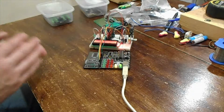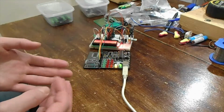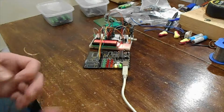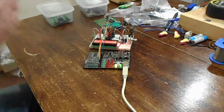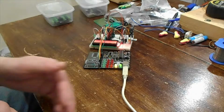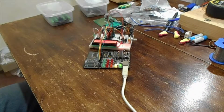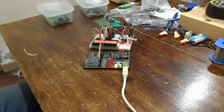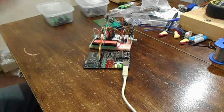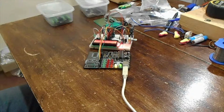So if you've got a section for your IR sensor, external memory, various external modules around, have it all on its own page. You break it up over separate pages, and your main program just basically calls each one of those functions as and when you need them, sends whatever data to them, and the function returns it, whatever it is you're doing. Because it's a bit cumbersome having it all on one page, and the things I've been messing around with, apart from the library files, have pretty much all just been one page programs.